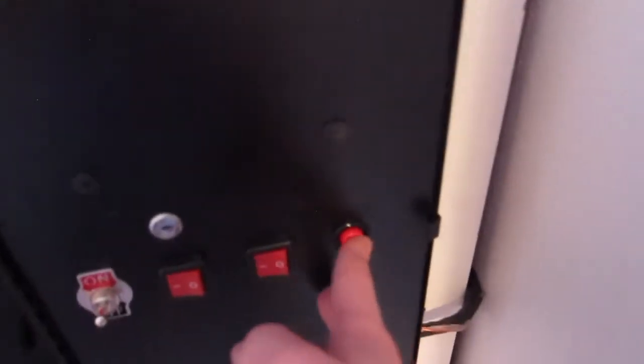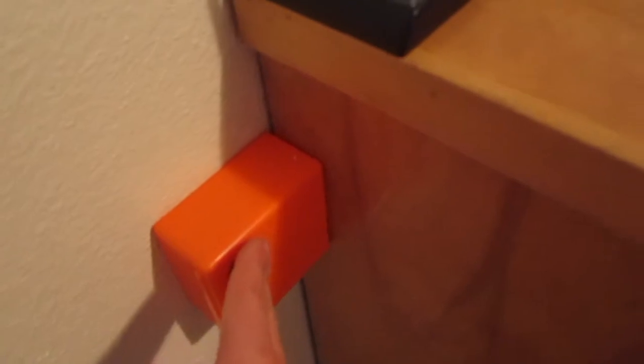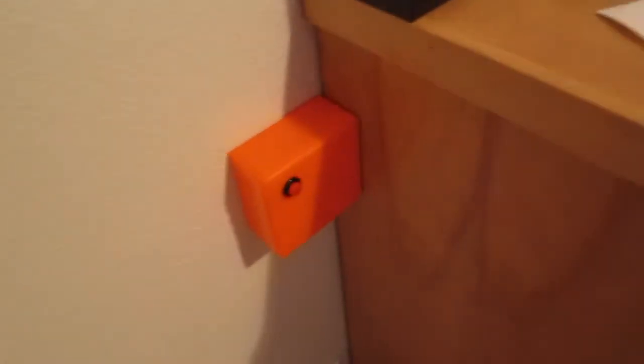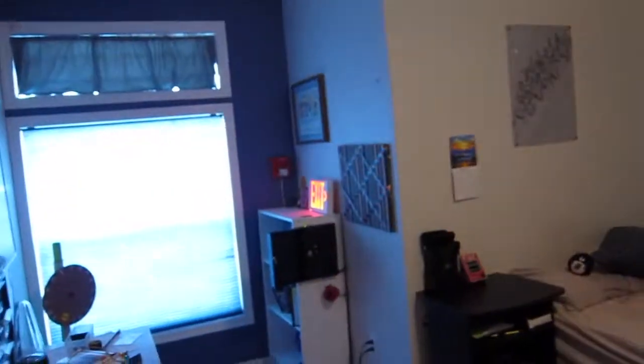Do a little push and hold test. Well, it's half working. I am working on installing an annunciator for the fire alarm control panel. So far I only have one switch wired up — it's the push-and-hold test. That tested every device. I'm going to add a disable zone 1, which would be the BG-12, then disable zone 2, which would be the BG-10L. And I might add LEDs soon, so I'll have a cool annunciator here.